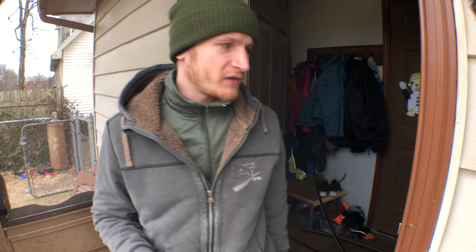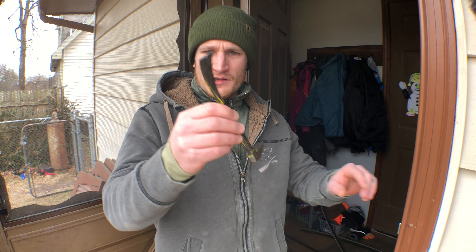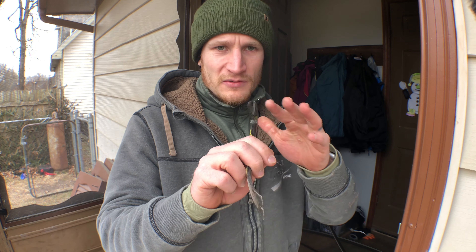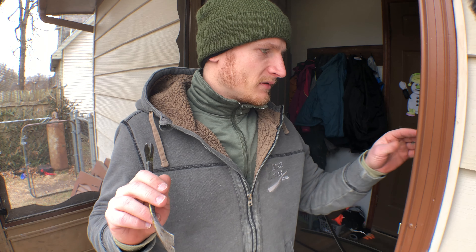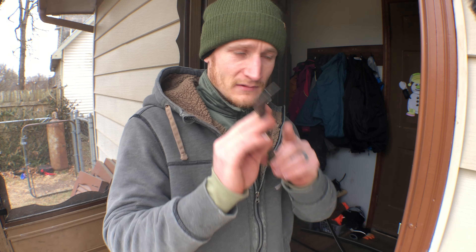As with every project I've ever done, it's about rolling with the punches. I know I've got nails here, so I'm gonna take this little pry bar — it's got a flat edge, really thin — and I'm gonna take a hammer and pound those nails in and break them down. I don't need them. My new weather strip does not need nails at all.